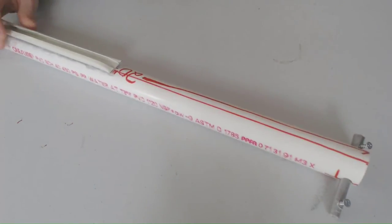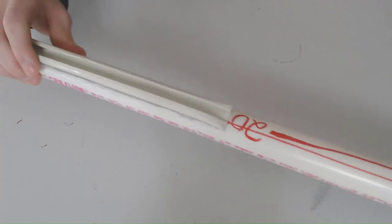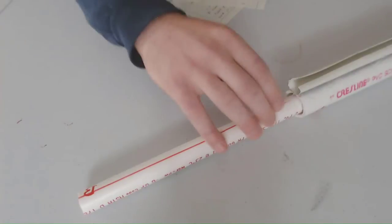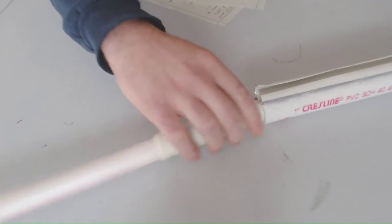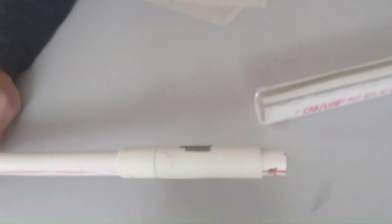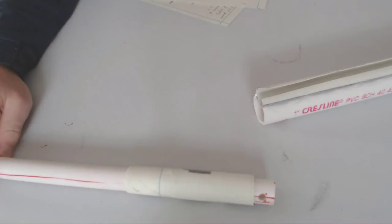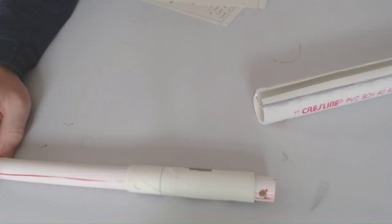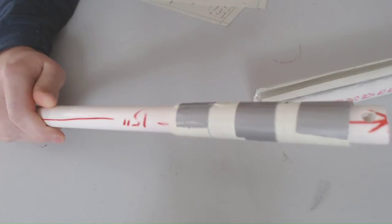Next, we're going to talk about the legs. The telescoping legs were made with a 20-inch long 1-inch PVC, which is the one you're seeing now. That's used as the outer pipe, and as well a 15-inch 1/2-inch PVC as the inner pipe. The inner pipe needed to have a diameter increase to allow for it to sit inside without wobbling. So I used 5 sheets of paper and then duct taped them together. That created a nice roll for me to widen the diameter.